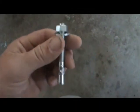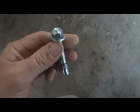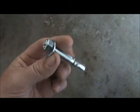Today we're going to use these 3/8 inch wedge anchors, 3 inches long. You drill the hole and pound these down in there, tighten them up — they can hold a few thousand pounds each. We're going to use four of them.